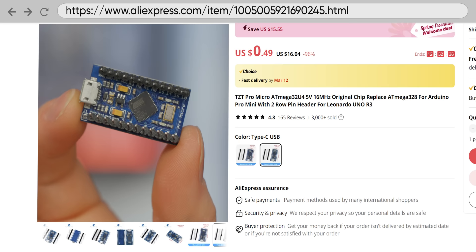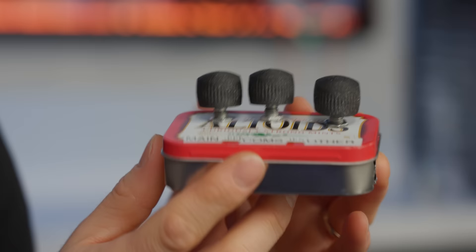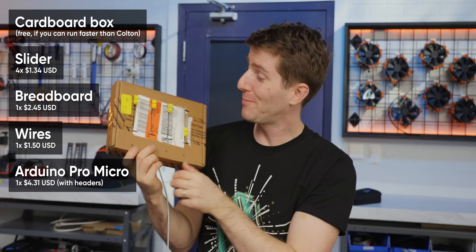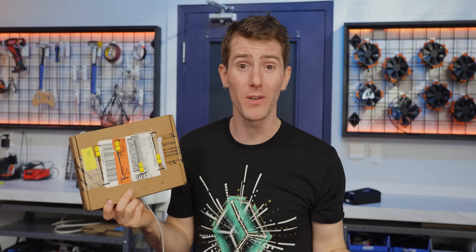To build our own, all we need is an Arduino or similar microcontroller, one or more potentiometers — pots for short — some wires, and some kind of enclosure. It doesn't even need to be anything fancy. It just has to be big enough to hold the electronics, but small enough to fit on your desk. This Altoids tin is a great choice for rotary pots and an RP2040-based board, while a shipping box has plenty of room for sliding pots and an Arduino Pro Micro. You do not need to know how to solder to make one of these if you pick your parts carefully.